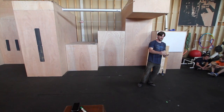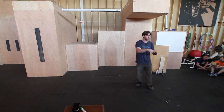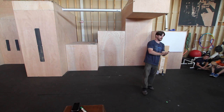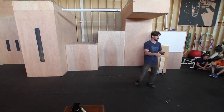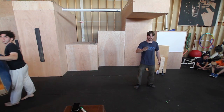My order of operations for knocking out things that will break down over time: if you're working with wood and nailing things together with no other connection points, nails will eventually start to pull out more and more. You can screw them together — it will probably hold a little bit longer but eventually the screws will start to pull out too. You can glue them together with screws or nails, and what the glue does is cut off the forces that act on the fasteners themselves — both the shear forces and the pullout forces.